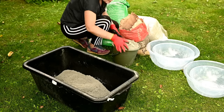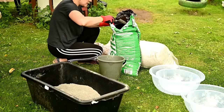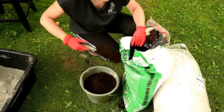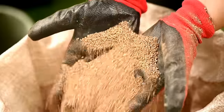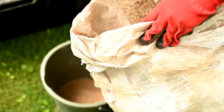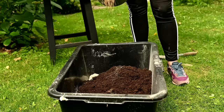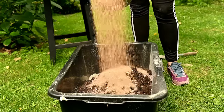I'm pouring two buckets of Portland cement into the mixing container, then a bucket of peat — I bought mine at a garden center. The third component is vermiculite. It is also sold as a soil additive but in small packages it comes out quite expensive; I found a large bag and it's way cheaper. You can use perlite — it's more cost effective — but it's white and you'll be able to see white particles in the finished product, so I decided that vermiculite would work better here.